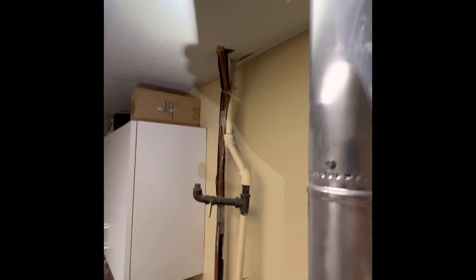Our current AC runs through the drop ceiling, comes down here, behind there, and then goes out to our outdoor unit. Our drain line has a condensate pump on the side. We'll send out a new condensate pump and redo our condensate drain line as well. It looks like it's got significant age on it, and our AC system is pretty old as well.